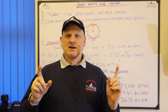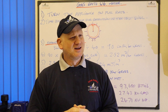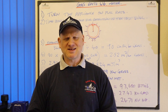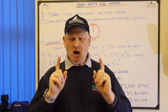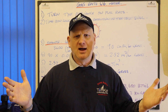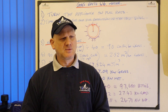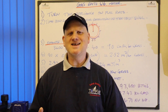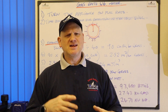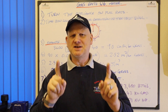Now in the training manuals for boilers it says gas rate them in maximum and minimum, but the benchmark book says it wants it in hot water and central heating. I've done gas rating in maximum and minimum - that's for flue gas analysing. Gas rating - central heating - combi boilers that modulate can help you diagnose faults. So if the customer rings you and says they've got no hot water, and you go to the boiler and gas rate it, and it comes out at a full gas rate, then it might be the diverter valve passing and putting that heat into the central heating. And it's the same for if you find out the gas rate is low, then there could be some other situations, things like blocked plate heat exchangers. Gas rating can help you diagnose faults as well.